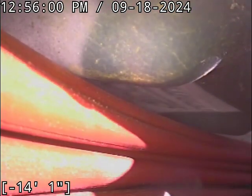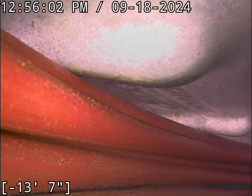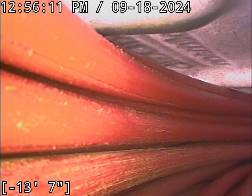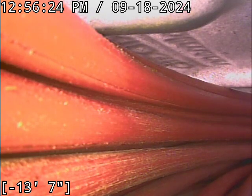That one habit alone does a great deal to keep your line clean, and it helps to mitigate blockages that should really break loose on their own. A lot of people don't even realize blockages happen when their kids ball up toilet paper. The head pressure that builds up behind them for a few feet often breaks the stuff loose. But if you get a line that's completely gunked up with a half-inch thick layer of grease buildup, that same blockage that would otherwise break loose ends up sticking really well. Something that shouldn't even cause a backup ends up getting to that point. So that's the PSA for the day on grease buildup.